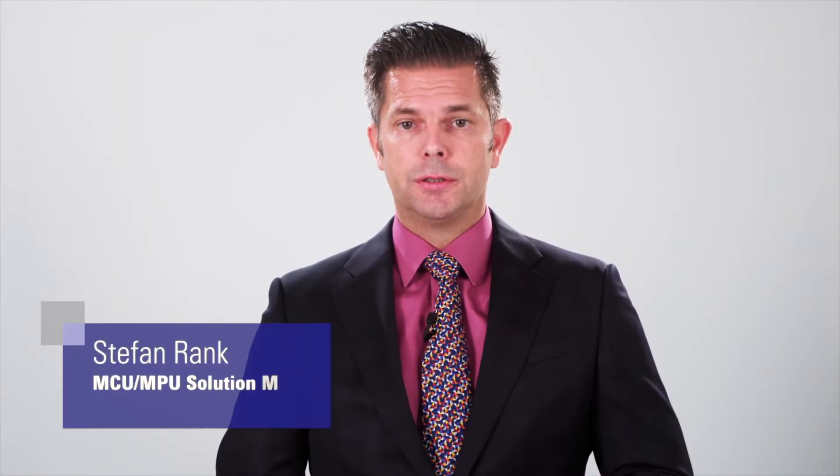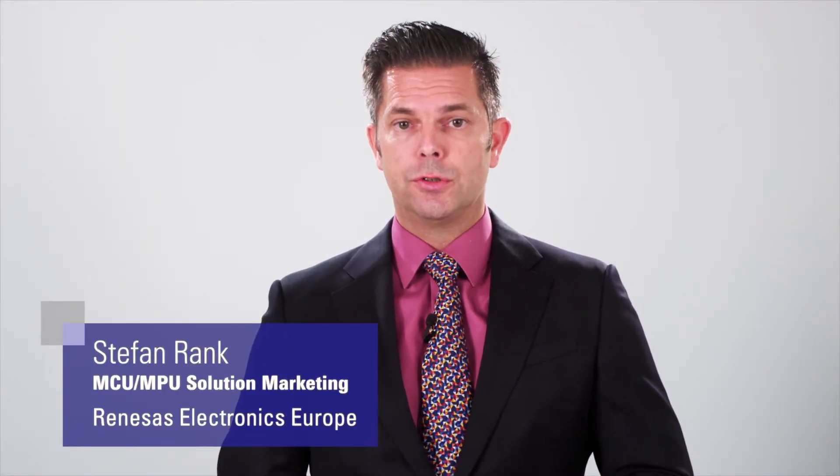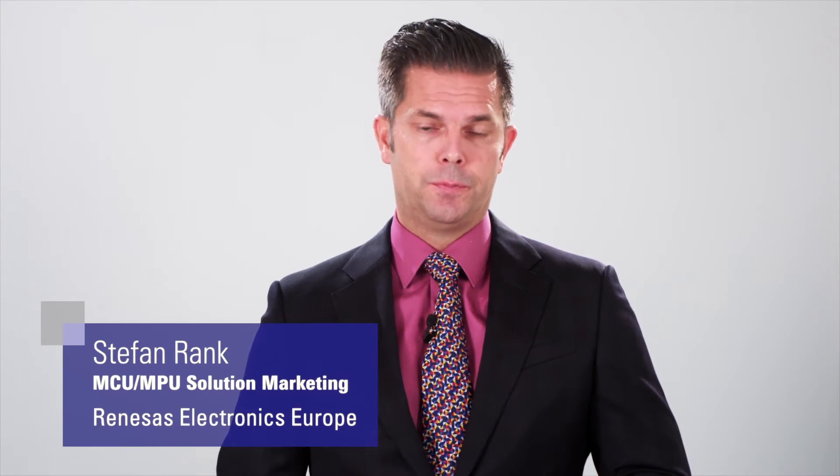Welcome to this demonstration of TARA Embedded Wizard on Renesas' new solution kit, Streamit RZV2. The Streamit RZV2 is based on the RZA1LU MPU which runs at 400 MHz, provides 3 MB of embedded SRAM, and is optimized for HMIs from the ground up.